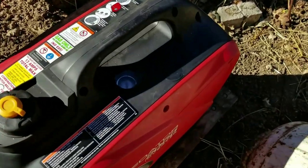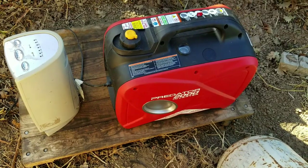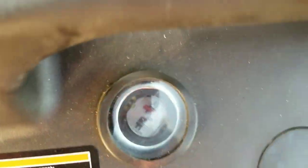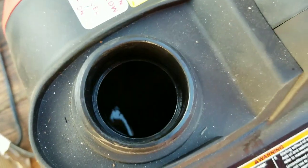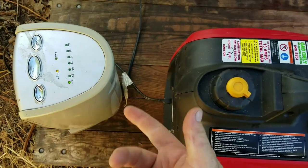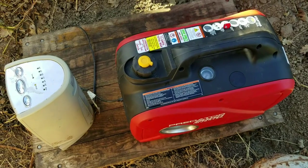Alright, so it's three o'clock now — right about there, so keep rolling. Okay, now it's about 3:45. The gauge is actually hard over. There's a little more left in there — I think it's going to make it to five hours at what I consider full load, which is almost 1500 watts. This is rated for 1600, so close enough.